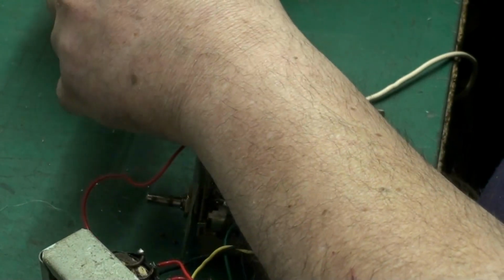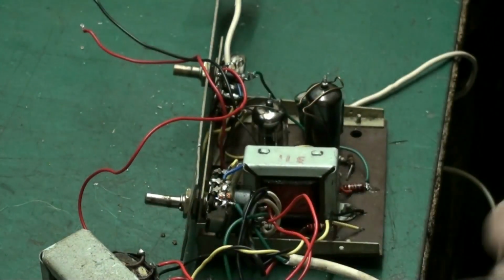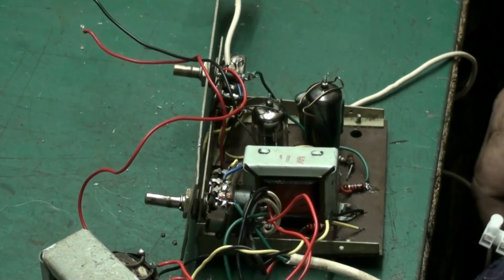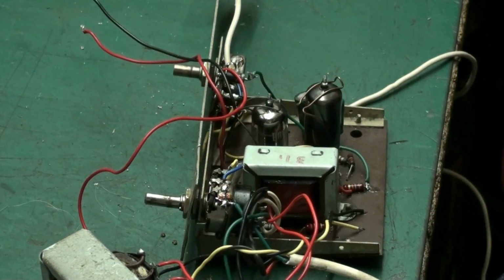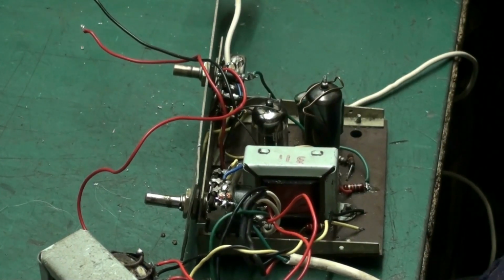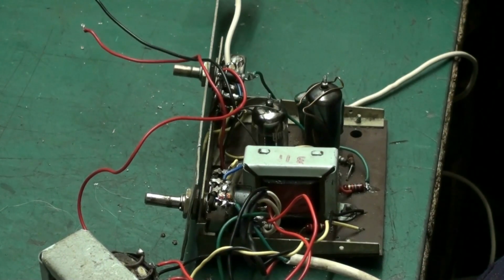What I might do actually after, I might get my crocodile clips and lead and wire and stuff, and I might make up some patch leads like this one here, so that if I need to, I can connect the original speaker and stuff like that, make up a range of leads. Another thing I need to think about is scrapping certain items I get, because I could do with one of these Dansette transformers about this size, because this would power all the Dansettes. Before I put this in, and to make it easier for me now rather than struggle with the wires, I'm going to re-tin the speaker leads.